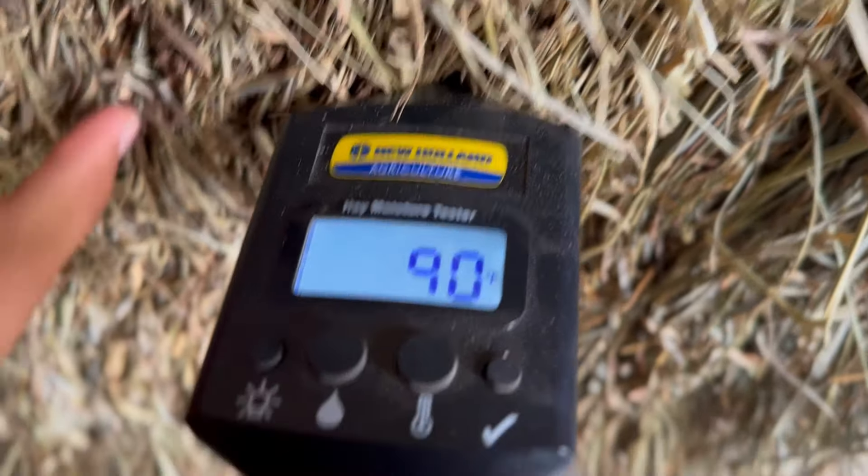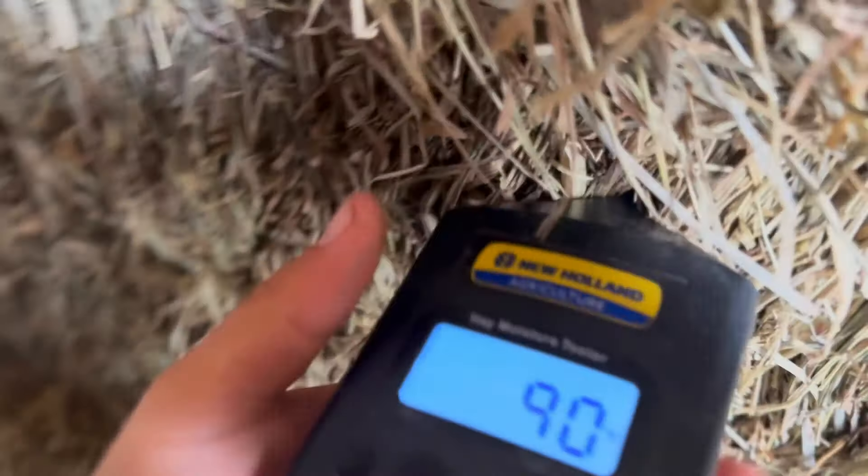This wasn't one of the really bad wet ones but it is a little bit warm. All hay heats and sweats — even relatively dry hay at 15 or 20 percent will heat and sweat a little bit. Eventually after the curing process, once it finishes sweating, that heat will come back down. There's just this period where I need to test this hay and make sure it's not going to burn my barn down. If you're interested in this probe, I'll put an Amazon link below — they're about $300, a little pricey, but really nice for testing bales.